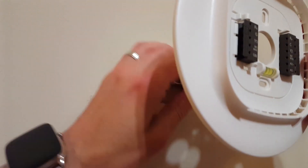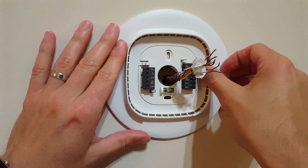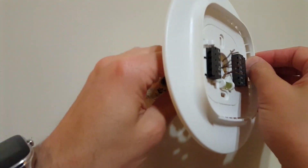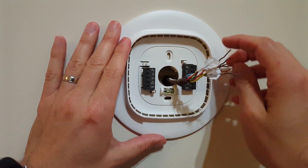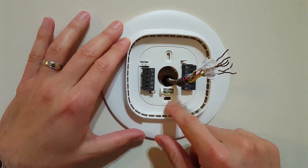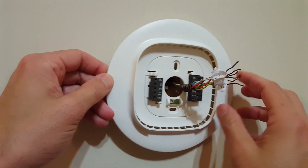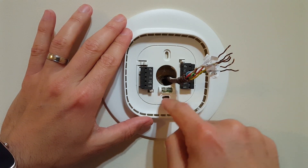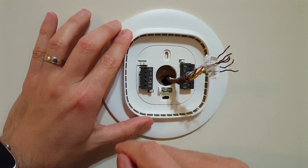If I put this other piece up, it covers everything really clearly, so we'll go ahead and use that. After a little bit of work, what I've decided to do — when you push the wires through — you can see that big hole from the original HVAC installer. I'm going to put one screw up high enough to go through the drywall all the way through to the wood behind it, which was presumably put there exactly for this purpose. I'll use one through the drywall and one to the wood to hold it in place, then we'll begin the wiring.